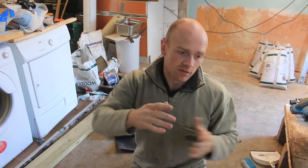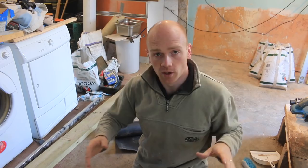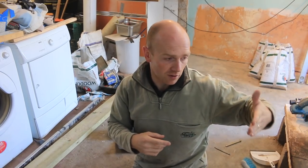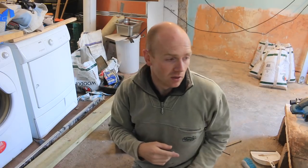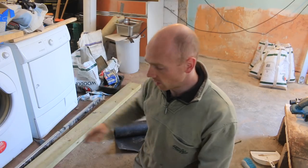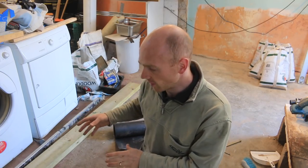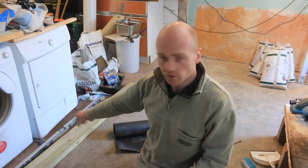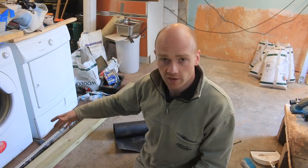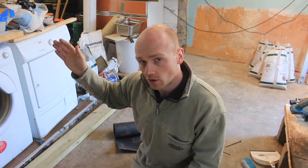It's just going to make a much nicer flow, especially because we're going to have a new cloakroom WC in here, so we want it to be accessible. We've got a solid wall that side, so we can put a nice strong ledger board onto that wall. Over this side I need to come up the same amount — I could do some block work or brick work, but as I'm working with timber I'm just going to use pressure treated 150mm joist material — six inch stud work — up to the same height, and then our joist will sit onto that.